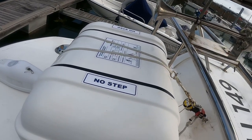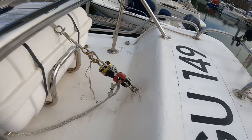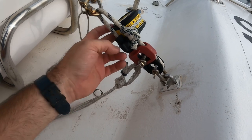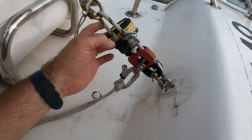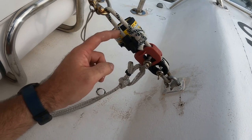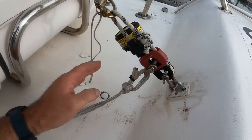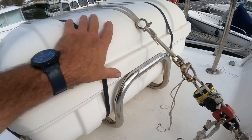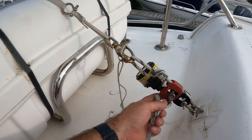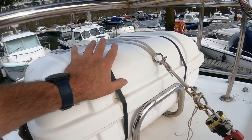I've got a six-man life raft housed in a casing, rigged to a hydrostatic release. There's a pressure switch — if the boat sinks, a pressure pad activates a razor blade which cuts through here. This whole section cuts away, leaving the raft to float free. The painter line that inflates the raft is attached to a weak link, so once inflated it breaks free — this life raft will launch itself automatically.